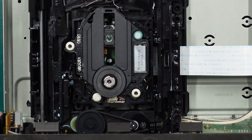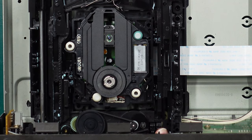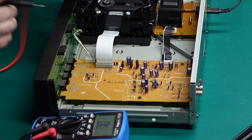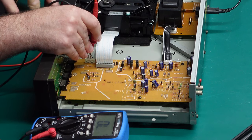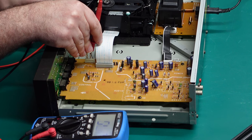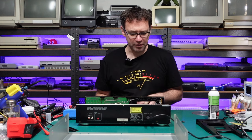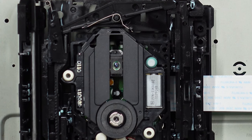Powering on — we get our motor spinning. Let's try the first switch: not stopped but no activity from the laser. Try the second one — also no activity. Let's make sure those signals are actually getting over to the board. That's one of the switches, which is working. The other one — yep, that part's working too. So I think we can rule out any issues with the switches. They both seem to cause some kind of behavior and they both appear to be working just fine.